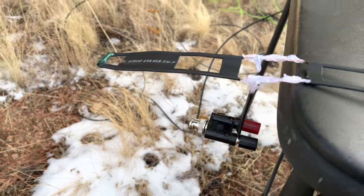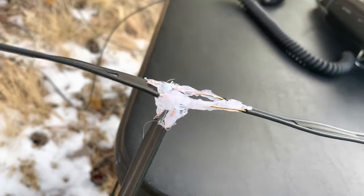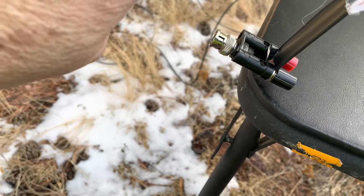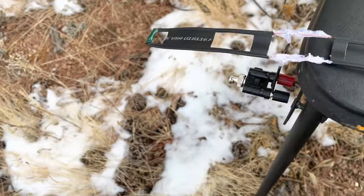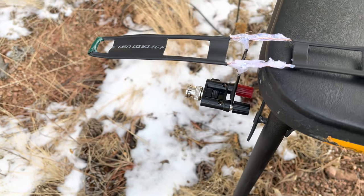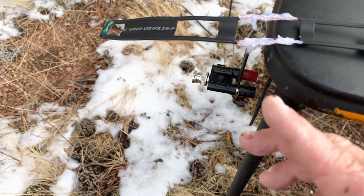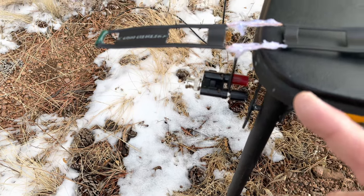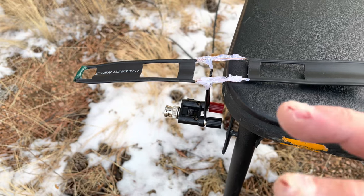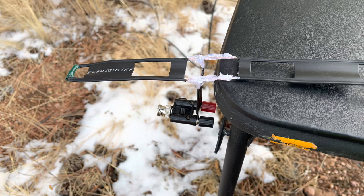I made an extension of window line here that's connected on the antenna, and then I have the two ends going into binding posts. We exposed a bit of the line here because we weren't sure where the feed point was going to be soldered, so we had enough exposed that when checking SWR we could go back or forward for the connection point before soldering.